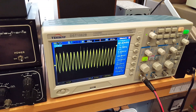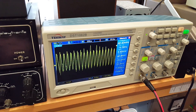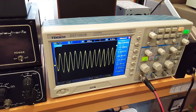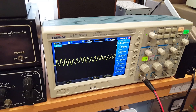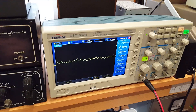We can raise the frequency even higher — this is 60 megahertz. You might expect to read 60 megahertz as the stock bandwidth of this scope; however, this scope has been hacked so it will do a full 100 megahertz. The level does start decreasing a little bit as we surpass 100 megahertz — we're going to reach the minus 3 dB cutoff point of the input filter of the scope. As we go higher in frequency, the level displayed by the scope decreases. At 300 megahertz, the scope is not at all able to display the signal — it's really just showing a bunch of garbage.